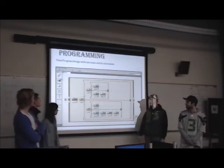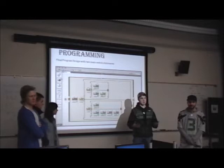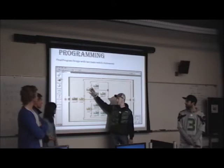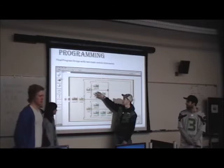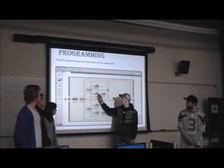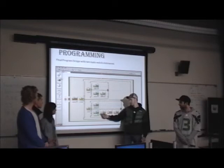This is our final flowchart for our final program. Over here we have the sound sensor — this is going to activate the robot. It just sits there until it gets sound input at some decibel level. Then it goes to the ultrasonic sensor and looks for a couple of conditions. If an object is closer than a specified distance, it bumps to a strike loop. If not, it just keeps walking and doing its scorpion thing. But if it's still far away and you cover the light sensor — if the light input drops below our threshold — it will stop all motion and play a snoring sound. Effectively, it goes to sleep.